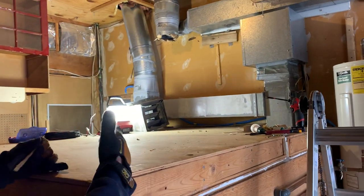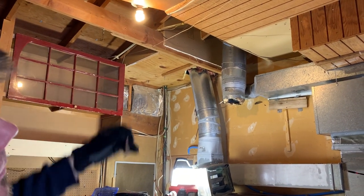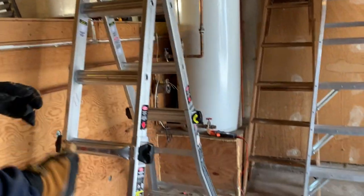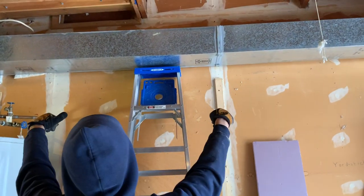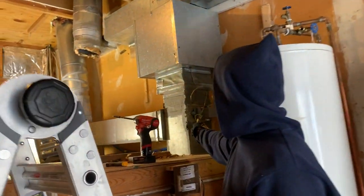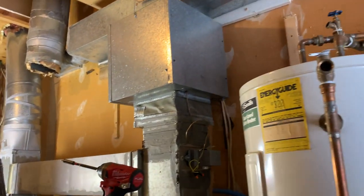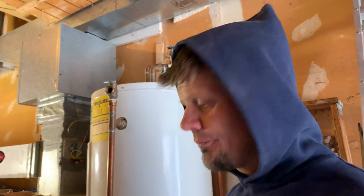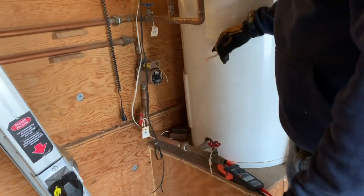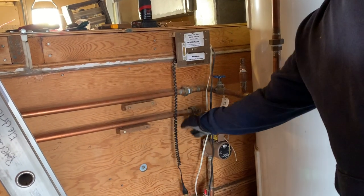This gigantic box here contains rocks and a couple radiator systems for solar heat that's collected in the collector box. Up above through there are six solar panels for water. He built this duct system here that vents through the living room, and put in some dampers with some speaker wire and a damper on that side to bring in the hot air — summer versus winter.